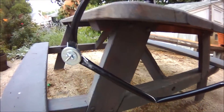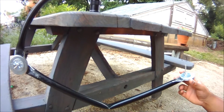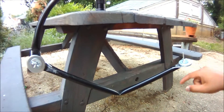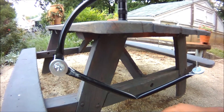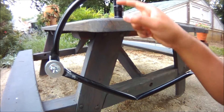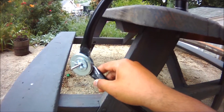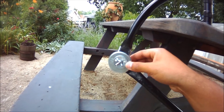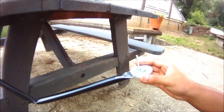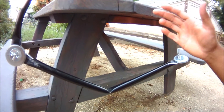These washers used for weights cost maybe around 60 cents a piece. The arms, which are the most important part, are aluminum tubing used as deck balusters. My dad and I bent them over the knee and took a sledgehammer to the ends to make them flat so I could drill holes in them and make a hinge. Rather than adding more weight, I can pivot this arm to move the lower counterweight further away from or closer to the pivot point.